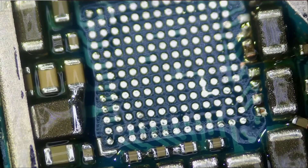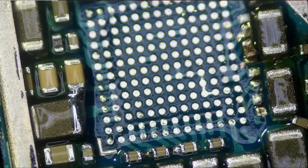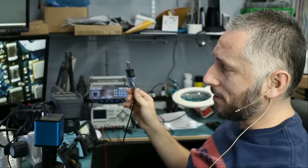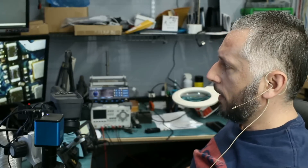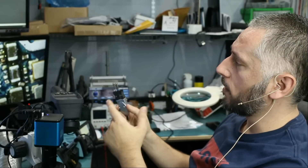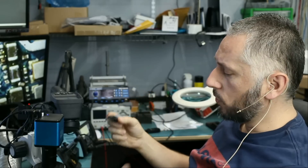That's amazing — I'm really impressed by this hot tweezers desoldering technique, and now I'm even more impressed with this tip. A bigger tweezers tip means a smoother process. I was able to easily desolder solder balls off pads in the previous video — you can look it up by searching for desoldering with hot tweezers. But it's even better with this bigger tip because there's more heat transfer, which is why I got this 10 millimeter tip for bigger pads, bigger solder balls, and ICs.